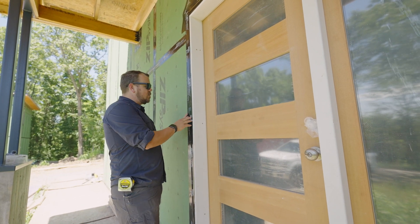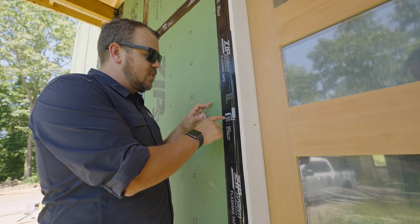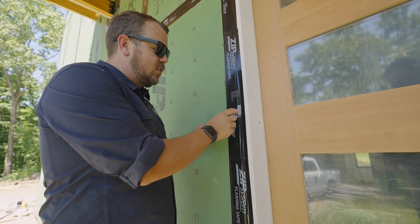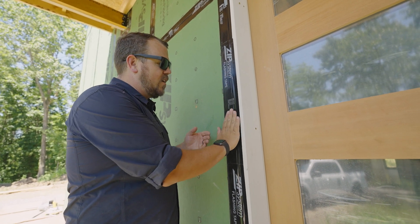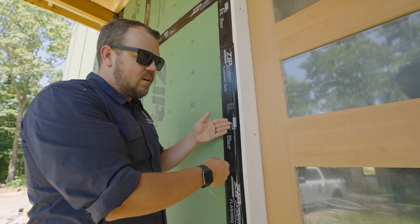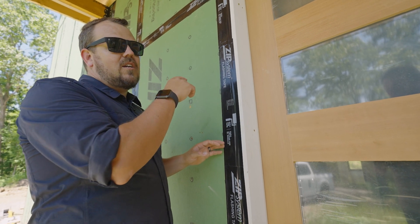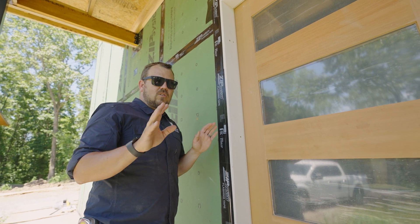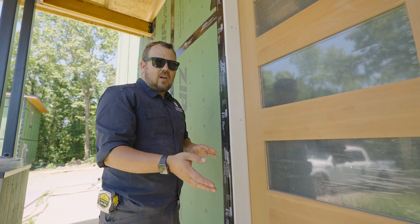Let's talk about that air and water management. We've done the same thing as on the windows here — we've pushed the frame of the door 3/8 proud from our zip sheathing, and this is zip tape covering our batten UV rain screen. Our trim will go on here, and our siding will come over and fasten as well. We still have a rain screen behind it. We have a little divot in our tape between the frame and our rain screen, so that we have a little bit of a drainage plane between the two. We've taped the sides and the head on those three sides, so we're watertight there. Then we just have to worry about how we're dealing with what little moisture might get down below, splashback, and air sealing.